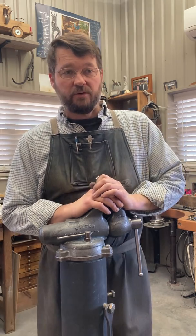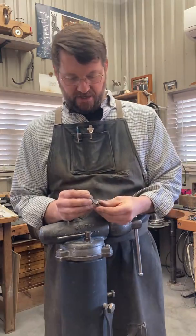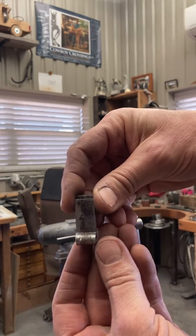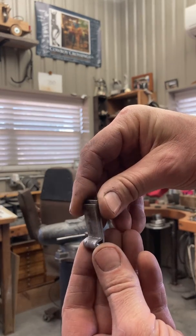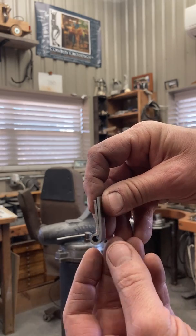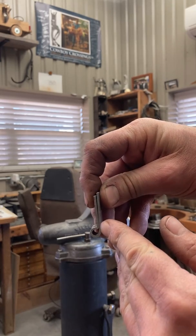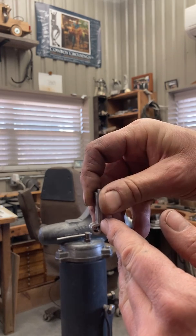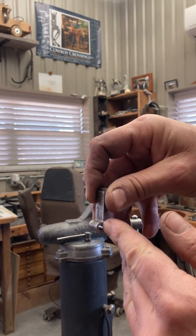And away we go. So, the tip, what we're doing? Hinges. I'll see this a little closer. Is that better? That's the hinge. That's what holds a button on the spur, and this is for swinging. One of the criteria to me that's very important is that right there, that crease. I want that to come to a 90-degree angle. You see that nice crisp corner that happens there.